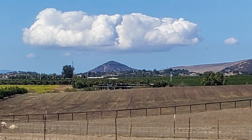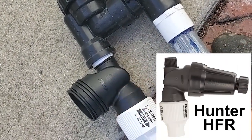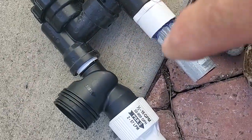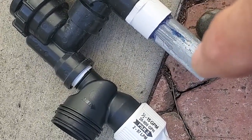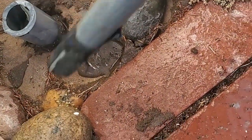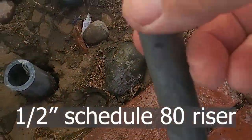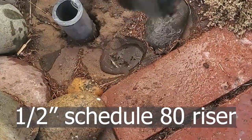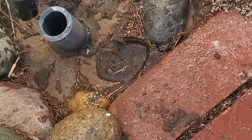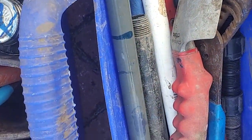This next item was at another site. I just installed this HFR here — the valve assembly looked like that, but this is a drip line and it keeps blowing emitters. So I put this on and I've got this assembly ready. In this case I've got one-inch schedule 40, and to displace the water I've got a half-inch schedule 80 riser with electrical tape on the end — it fits right in there and stays.